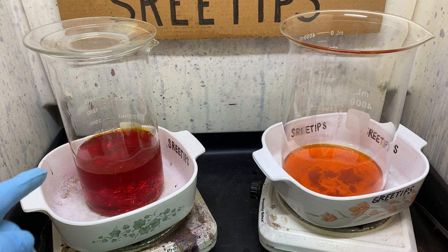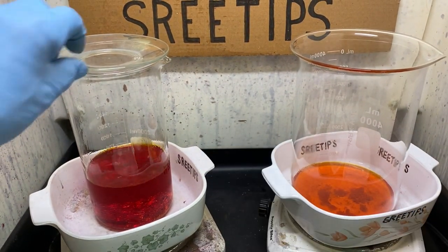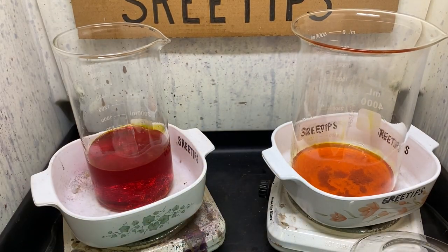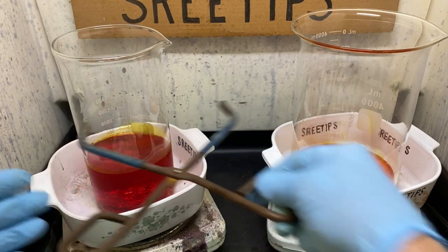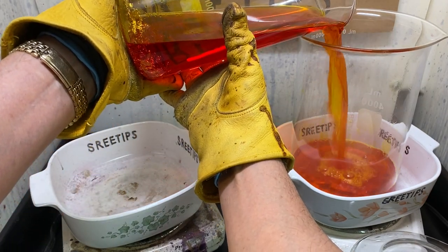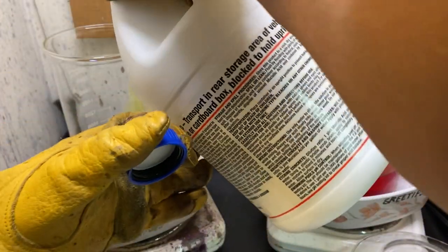It's been about a half hour since I last added any of the material to this. I did get all the additional metal put into the beaker now — I've got all the metal in our reaction. What I'm going to do here is transfer this material — the liquid rather — out of this beaker. That's kind of heavy, I better get a pair of gloves here. I'm going to transfer this gold solution into this beaker so that we can evaporate this down. While I've got this solution in a separate beaker, notice I've still got a bunch of metal in the bottom of this one, so right quick I'm going to add some hydrochloric acid.